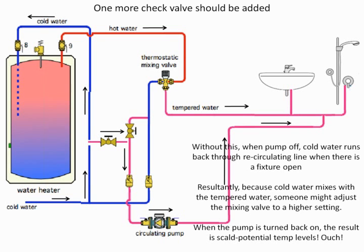There's a question on that, Julius, on the solar systems, because some guys will put in a two-tank system where they'll leave the existing water heater and put the solar tank in first. That preheats the water to whatever temperature it gets. And the question is, does the thermostatic mixing valve go on the solar tank in case it gets up to 180 degrees? Then it'll just flow into my water heater that's set at 120 and it's not a problem. Or where does the recirc tie in?